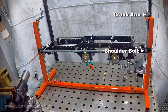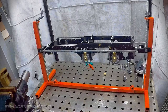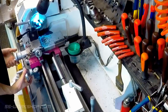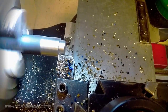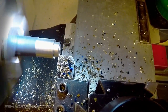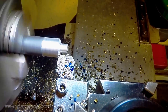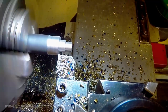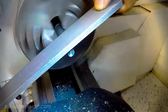Shoulder bolts, crank arms, bushings, turning an end on the threaded rods, some crank handles, and a locating wheel. I start work over at the lathe turning the shoulder bolts. These are being made out of some mild steel round bar. I work out the shape working back towards the chuck — this keeps the part as rigid as possible during the early cutting. I use a lathe file to clean up the part and remove the sharp corners.